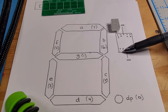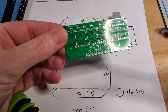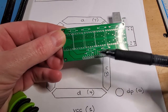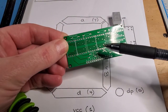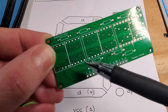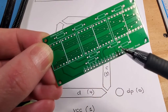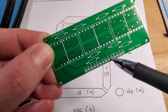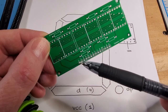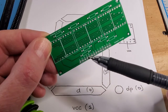The key question is: given this board layout where you only have the digit lines and segment lines, how do you actually control this? As you can see on this board there's no driver IC — you have pins for first, second, third, fourth, fifth, and sixth digit, and then a pin for each of the segments. The answer is multiplexing. Essentially what the microcontroller does is strobe through each digit in turn — one through six — and with each cycle it turns off or on the appropriate segment.